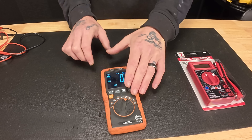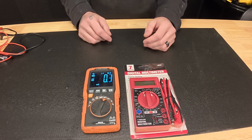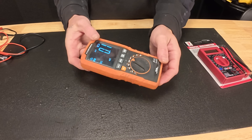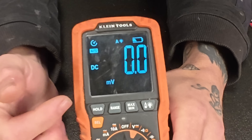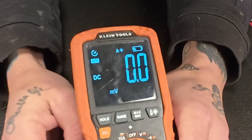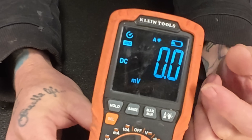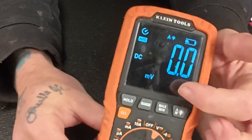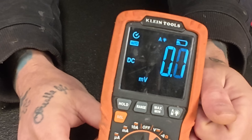These range numbers can be confusing: if you're checking DC volts on a battery, you'd set it to 20 — meaning you're looking for under 20 volts — or under 200, or under 250. Sometimes people get a little thrown off. With an auto-ranging meter, you need to pay close attention to where the decimal is and whether it says volts or millivolts. If there's a little phantom voltage in the circuit, it might read like 10 millivolts, but if you're not paying attention you might think you have 10 volts — and that will mess you up.